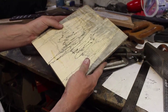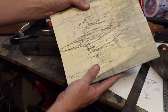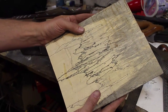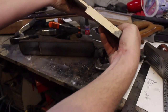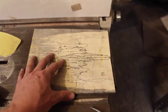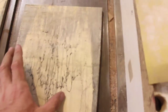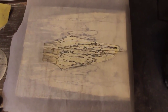Let's take a look at this bookmatch. So that's pretty wild — that's going to be right there in the center of our headstock. I hope that's somewhat focused, but that's what I'm hoping she'll look like. So I'm going to thickness down the back of this other one a little bit. I think we're in a position now where it's not going to take me a month to sand it. The boards are jointed really, really well here in the middle, so they fit together like a glove.